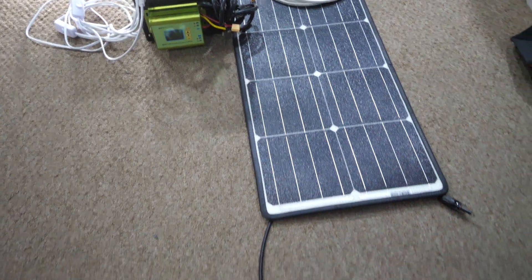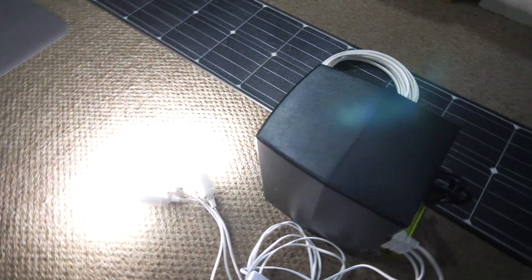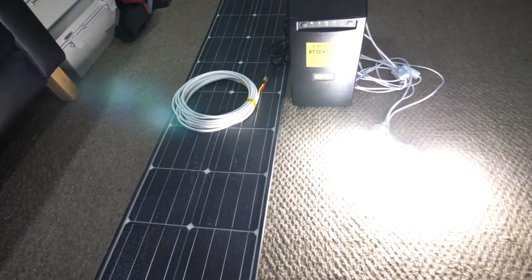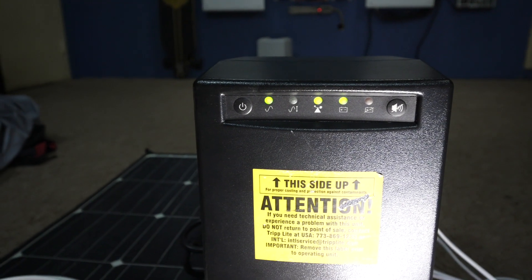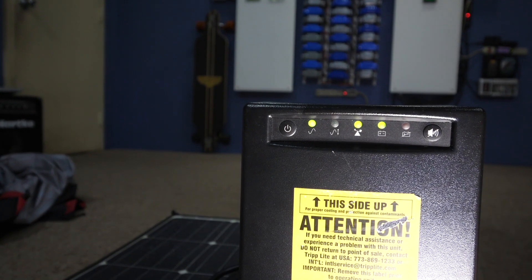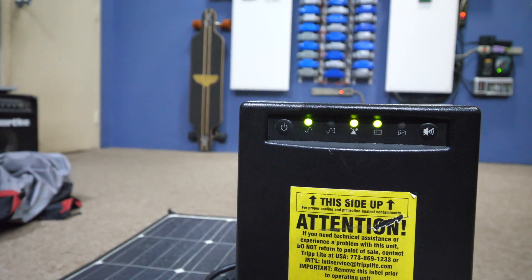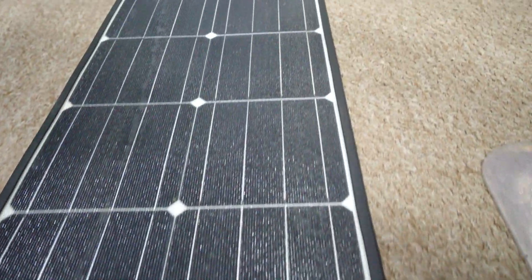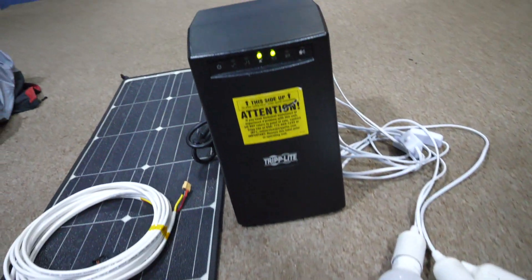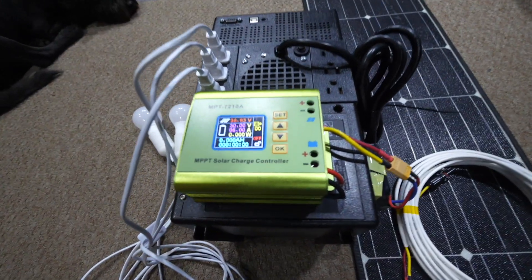There you have it — 600 watt-hours of energy storage, 900 watts of power, six outlets. Looking at the full materials list, it comes in at just over $400, and that includes the lights and 100 watts of flexible solar panel. This system is pretty much ready to deploy, easier to put together — you can do this in a couple of hours. Lower difficulty, lower price, lower parts count — it's a win-win. Let's make a bunch of these and send them where people need them. I ran out of time to set up the solar charge controller, but I'll link the best video I found for going through its menus and setup.